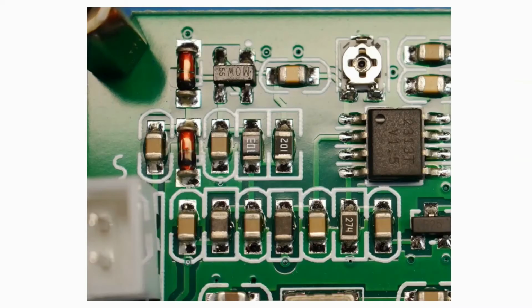Now, a little bit of just checking around with a meter on the front end. Here's a close-up of the front end. We've got the signal coming in on the left there, and the signal is fed straight to that capacitor. Now, measured in circuit, that's about 47N, which seems about right. And then it's possible to trace the circuit going across with two diodes connected cathode to anode there, and the signal comes in and goes across that junction of those two diodes and then carries on somewhere.